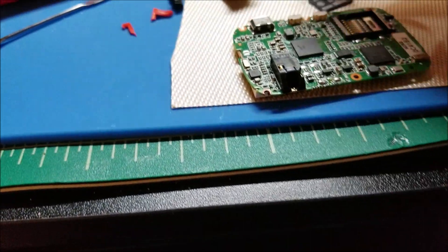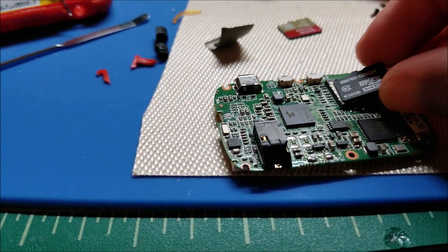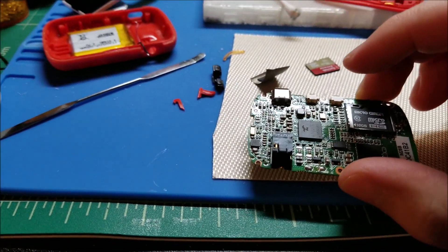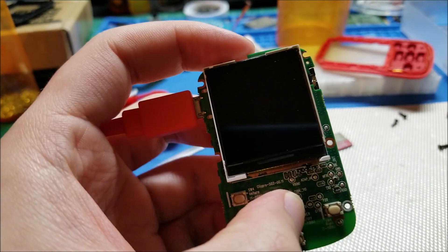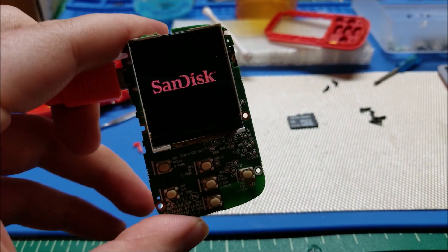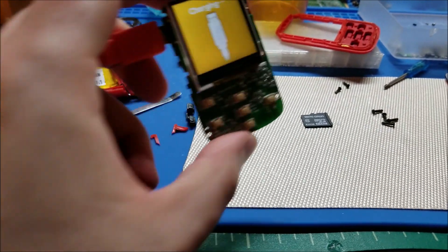So I pretty much copied the original files from the original micro SD card onto this new one. Both of them are formatted FAT32, by the way. This is just a cheap 32 gig — I think it costs like $4. To get the card in and out, you actually have to push it all the way to the front; there's a bit of room and you can slide it forwards and backwards. So let's just power this up — I haven't attached the battery but it can power off of USB. Not booting. I put the original card back in and yeah, it boots as soon as you plug in the power cord with the original card. So I wonder if there's like a hidden partition with the firmware, because it doesn't do anything when you insert the new card, even if it has all the same files on it.